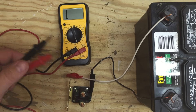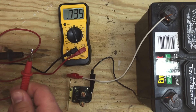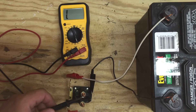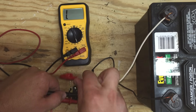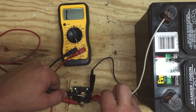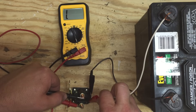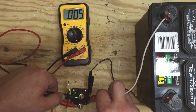I'm going to take the two ends of my tester, turned to continuity with the alarm. So if I touch them together, you hear the alarm. I'm going to touch them to each of these posts — it doesn't matter which — and touch the tip of these alligator clips, and you'll hear a click. And you see I get continuity.